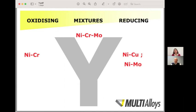Certainly, stainless steels do need an oxidizing environment, but sometimes even what they're exposed to may be too severe. The typical oxidizing environment, and this is all in a lot of generalities, just to provide some benchmarks to guide thinking: typical oxidizing environments are nitric acid, chromic acid, oxidizing and acidic salts, and phosphoric acid, but it's the version of phosphoric acid that's used in the fertilizer industry, where the phosphate rock is reacted with, I think it's sulfuric acid. Another quite strongly oxidizing set of conditions is in fact concentrated sulfuric acid, above about 80% concentration. That's also quite strongly oxidizing.